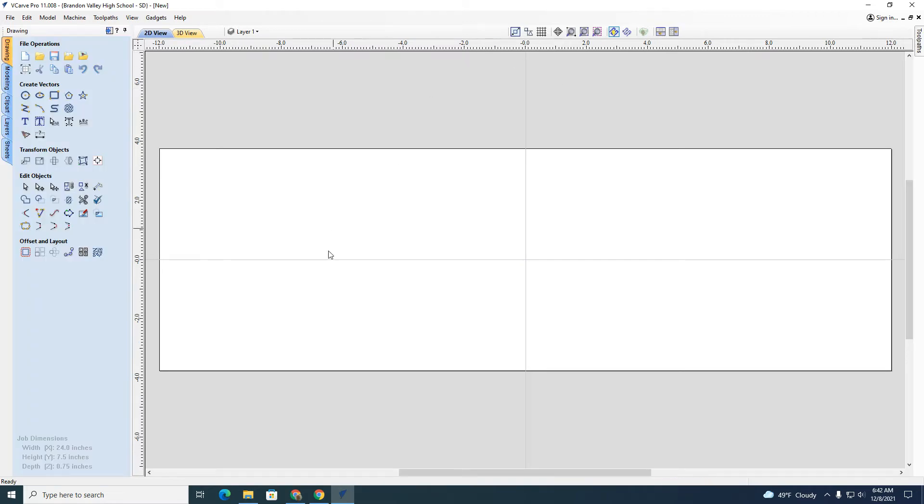Now I'm going to create this — this is the size of my material. It's very important that when I make my sign I don't go all the way to the corners or the very edges, because I have to clamp this onto the machine when I'm cutting it with the CNC router. I need room for the clamps, so don't make it to the very edges — give yourself some room.